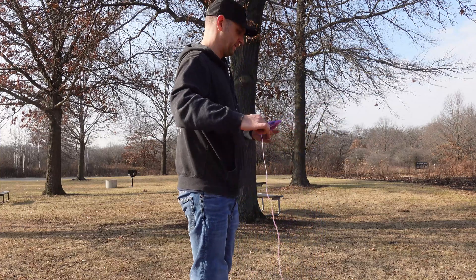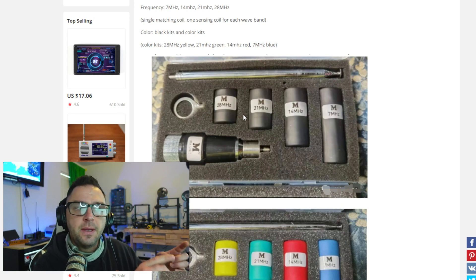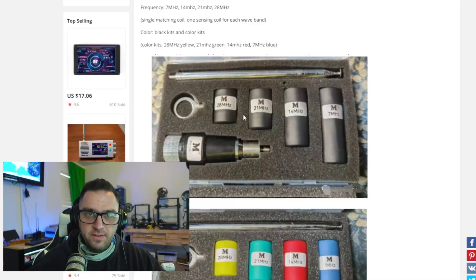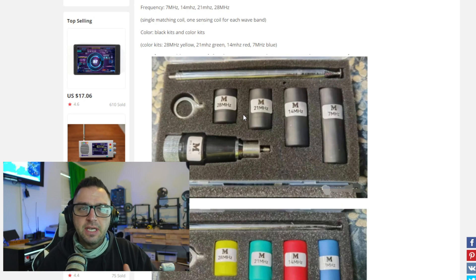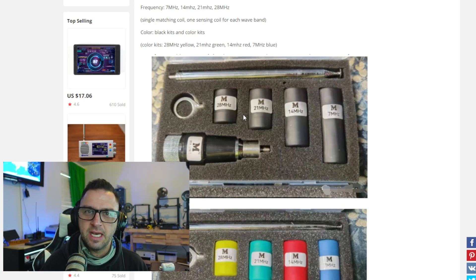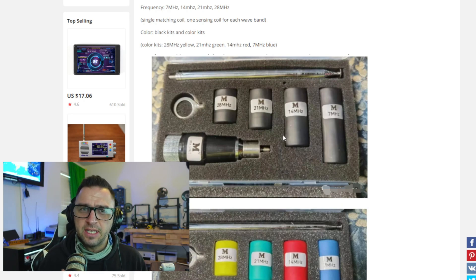We have the four coils and a very short antenna. When connected to the 40 meter coil with the M6 to SO239 adapter, it's about four meters in length. The coils help bring the tuning to the correct location within the band. On 40 meters we'll have a very narrow bandwidth, meaning you may need to adjust the antenna as you change frequencies. Toward 10 meters the resonant frequency range gets wider. The ring connectors on the left side are used for the ground plane.